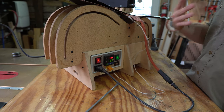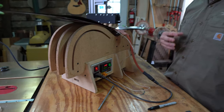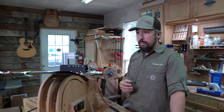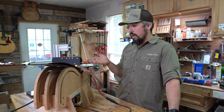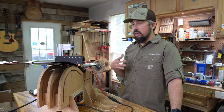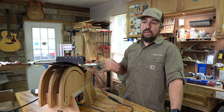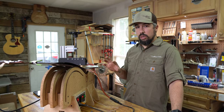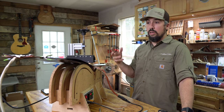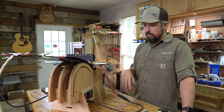It depends on the species of wood. If I'm working with maple, especially quilted or flame maple, I'm very careful about being too fast because it can break. Indian rosewoods and ebonies like this, African blackwoods — they don't tend to have any issues with splitting, so you can be a little bit quicker. As we get to 200 degrees you should start to hear a little bit of sizzle and cracking. I usually wait until I hear that so I know I'm generating steam, and then I start applying pressure.